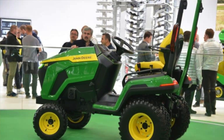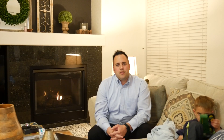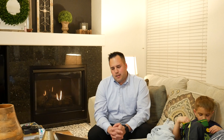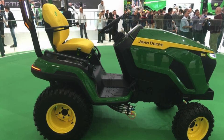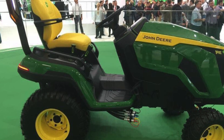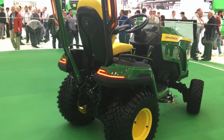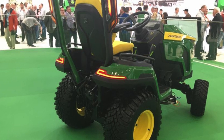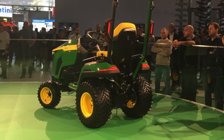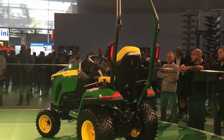There is some newer LED lighting for the front, the rear, and also on the ROPS — it has some nice detailing to it. There's a parking brake visible, and it's likely an internal wet brake system, same as what the current 1 Series uses. The rear end is also likely to be the same. There's still a hump in the middle of the operator station, so it's unclear whether the electric motor would be in the rear or the front with a drive shaft powering the pump. From the rear, a three-point rock shaft is on the tractor — the arms aren't there, but the rock shaft is — and I think I can see the stub of a rear PTO shaft.